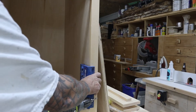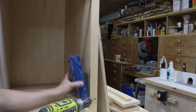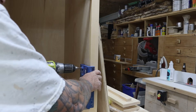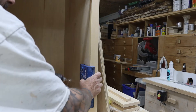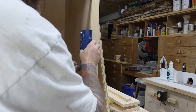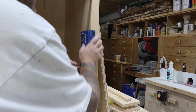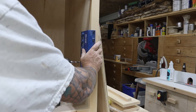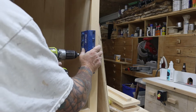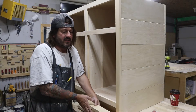I'm going to hold this in place — it's got a guide on the side that I can reverse to either side. I'll hold it into place like that, drill my first hole, and then use the pin that's going to be held in place. I've cut all my pieces — my stiles and my rails for my doors.